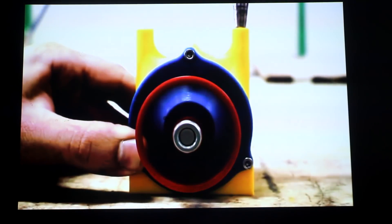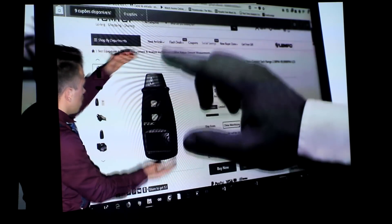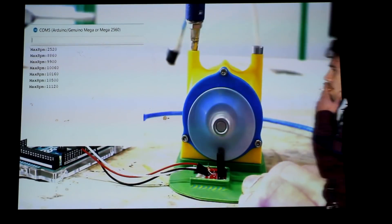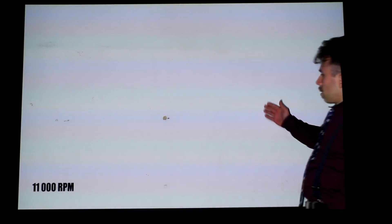In the first iteration, I printed the simple and easy-to-print design of the Tesla turbine. The result was pretty nice, but I had no way of seeing how fast it could go. Because I was too impatient to wait for the digital tachometer to arrive in the mail — which, by the way, is a device to measure rotation speed — I decided to build my own version using a photo interrupter and an Arduino board. Testing the turbine and reading its speed, I got a top speed of 11,000 rotations per minute. I was pretty proud of my results and I was happy with my low-cost digital tachometer.